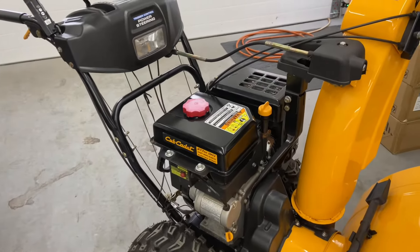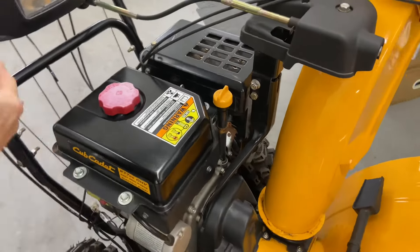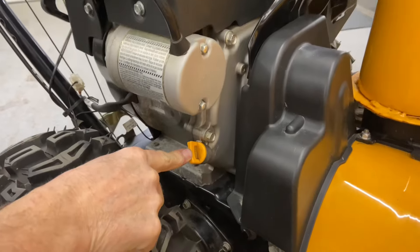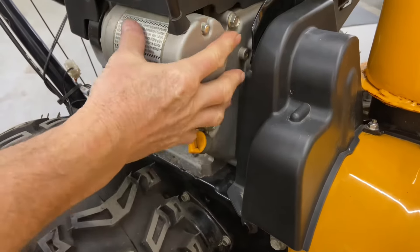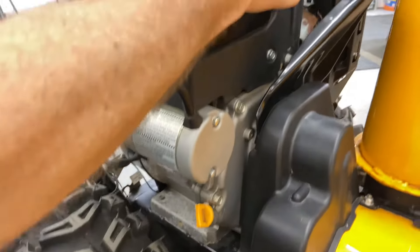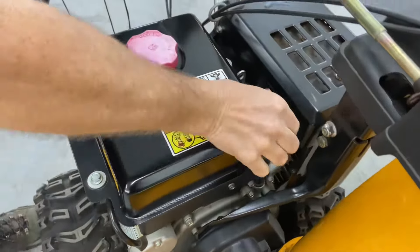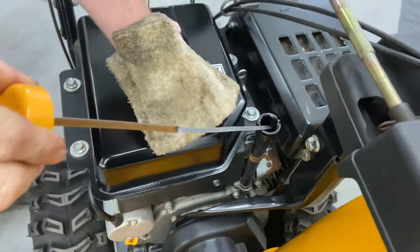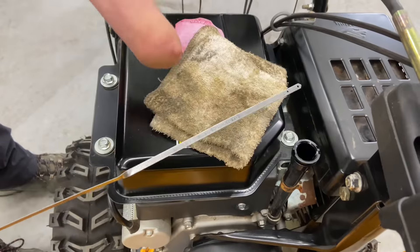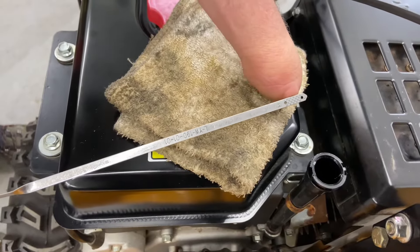The first thing you want to do when you get your machine is check the oil. A lot of people ask me, why is this cap over here — is this where you check the oil? This motor is on a lot of machines; you can check your oil here, but you have a dipstick right here, which is actually better to check the oil. Go ahead and turn it a quarter turn, pull it out, make sure you use a rag and check it — don't just pull the dipstick out and think it's got oil in it. It's got to go between these two dots right here in this bar graph.